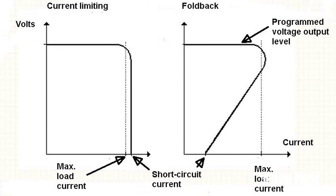Basically, when the supply puts out a current that exceeds the maximum value, the voltage still drops, but the current drops simultaneously to a safe value. Fold-back provides better protection for circuits, as a really bad short will result in very little current draw, so the supply won't be sitting there heating up while it puts out maximum current.